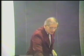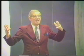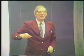Just a couple of miles away, and we built a real good set of blades. But later on, for production, these blades were fine up to a point, but we were looking for a better blade, and we also wanted to get a bigger diameter. We had too high a disc loading for a gyroplane. You've got to keep the disc loading down, so the rotor has to get bigger. If it gets bigger, you want to reduce the chord.